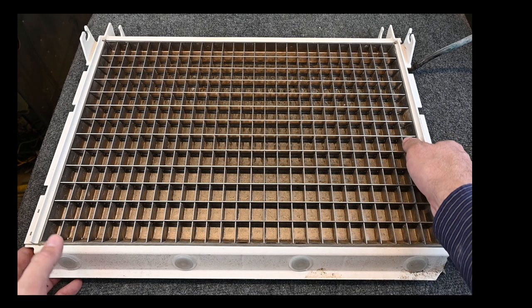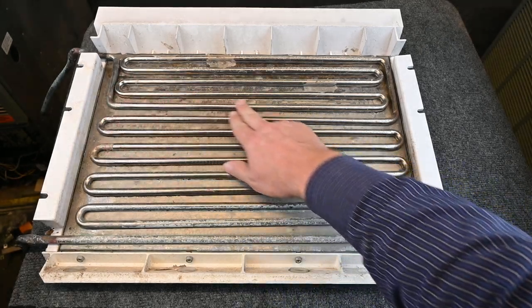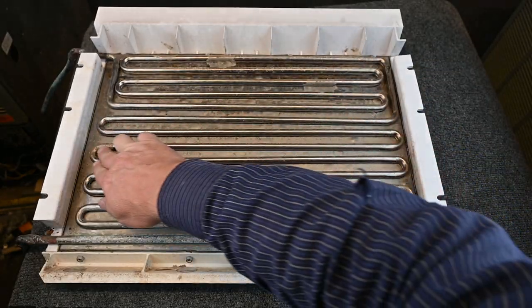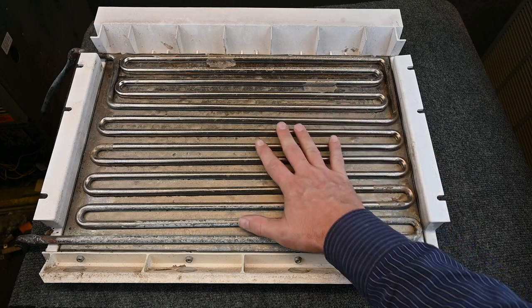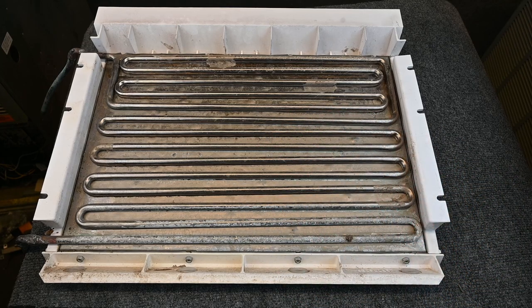Let's look at the evaporator side. Here you can see the back side of that evaporator coil and our refrigerants running back and forth in these different patterns that the manufacturer has figured out that's best for them. And so all we're doing is boiling that refrigerant from a liquid to a vapor, then we superheat the vapor and we come back out the other side, as we're absorbing heat from the other side of the metal and absorbing heat away from that water.